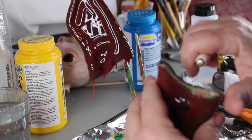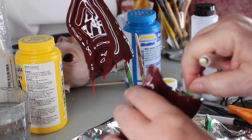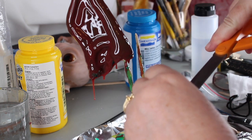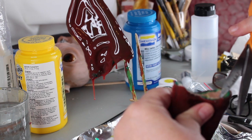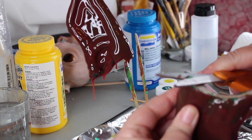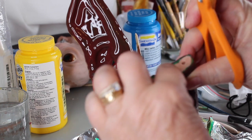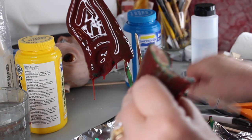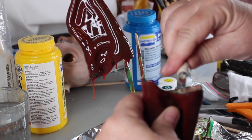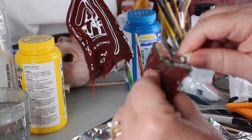in addition to me putting some silicone glue along the edge. So right now what I'm doing is I'm just cleaning up some of the silicone that spilled over. I want to be able to get the clay out, and we're just going to fold it back on itself, but I need to get to the clay to be able to separate it. This would have also helped if I'd had that lip, because I would have had a section of silicone above where the clay was. It would have been easier for me to separate it. That wasn't too bad, but it was harder trying to get the silicone out because it was right up next to the top of the silicone mold.